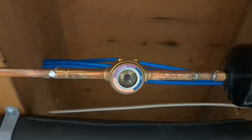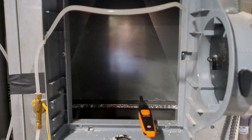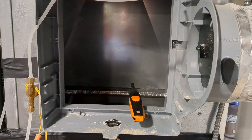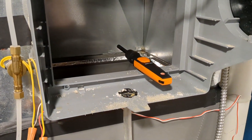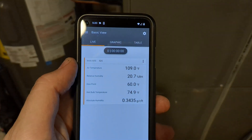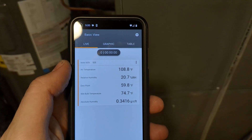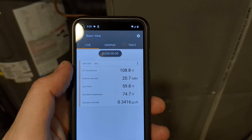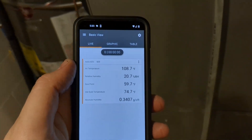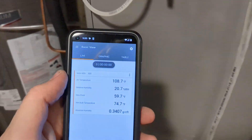The unit is working now — it's the next day. We ended up getting late last night so I gave up. I took my humidifier panel off just so I could get a probe measurement with my Testo probe. It's running in heat pump mode right now. It's about 56 degrees outside, so it's not really a workout for it, but you can see we're getting 108-degree supply air. That's pretty good.